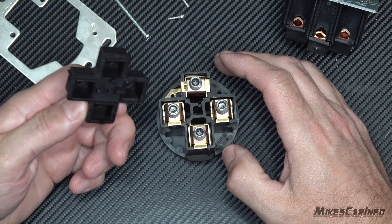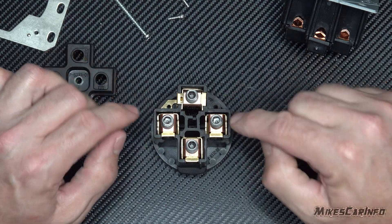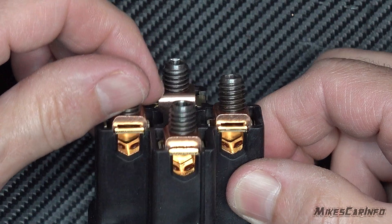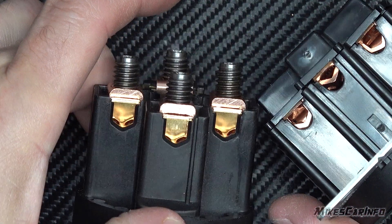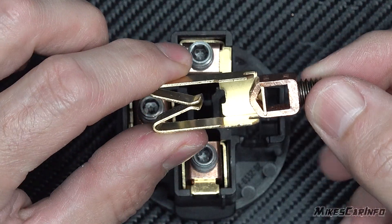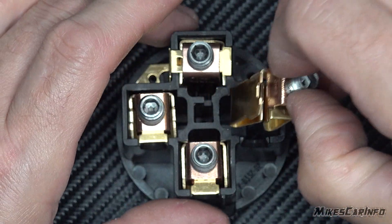You can see the inside has a little knob so it lines up properly when you put it back together. Inside there are fairly large Allen screws going into fairly chunky copper. You can see these are much thicker compared to the Leviton's copper, and that's probably why the Leviton stripped out. When you pull it out you can see how it works — it tightens and pulls in as you tighten it. There's also a chunky brass piece with a lot of pressure to contact the blade of the outlet.